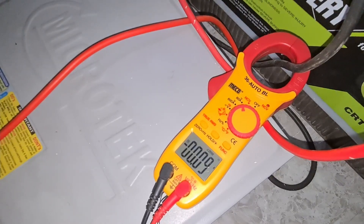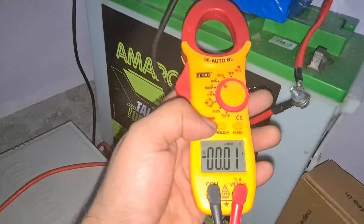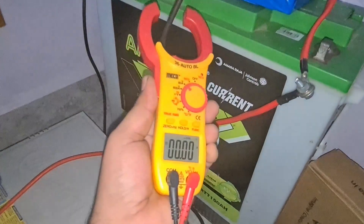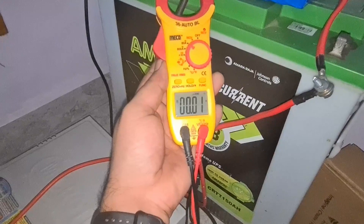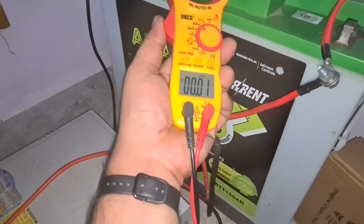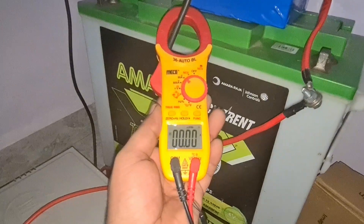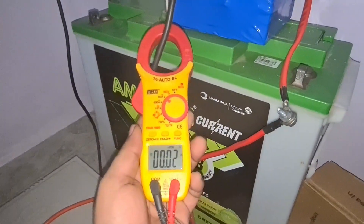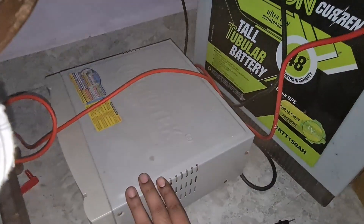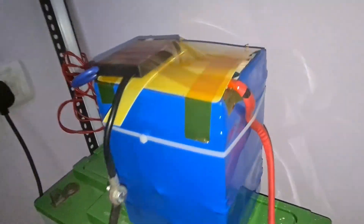The current dropped and now only 100 milliamps is going to the inverter. It's been two days since I connected this battery and it's been in a float/top charge state. Now there's only 10 milliamps going to the battery, and pretty much the inverter is not sending any more charge because the battery voltage and inverter voltage are nearly the same — it's fluctuating between 10 and 0 milliamps, which is pretty good. The inverter is a Microtech 1250VA, bought about seven years ago.